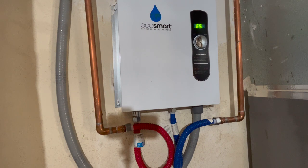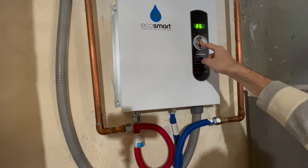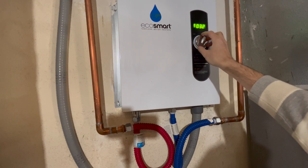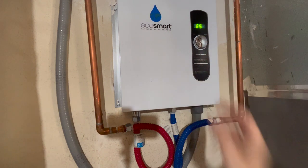Okay, this is not what I expected. So even with the flow regulator, I'm getting the E5 error. The bathtub can still go past what the water heater can handle. I'll use the menu in the water heater to check the flow rate — more on that later. So the bathtub is still using 3.2 gallons per minute. It's less than the four gallons we expected, but still more than the heater can handle.